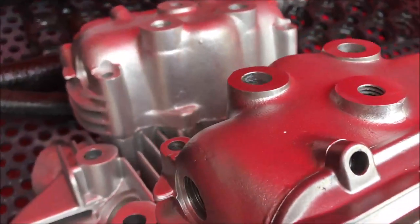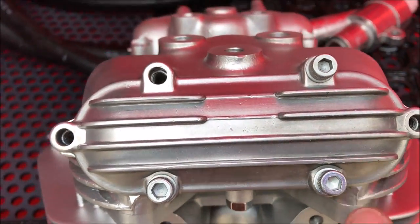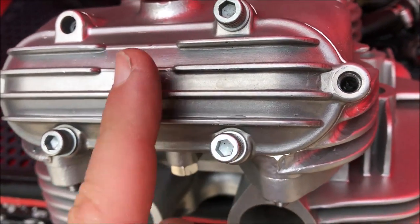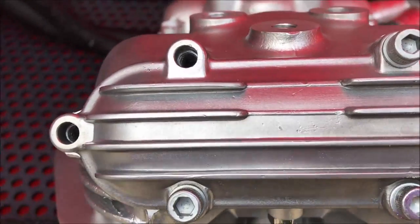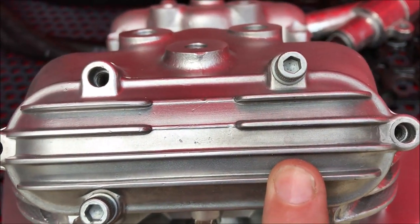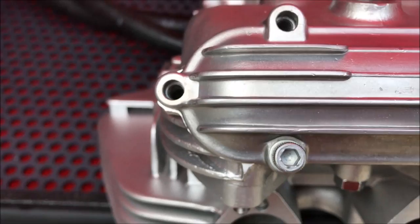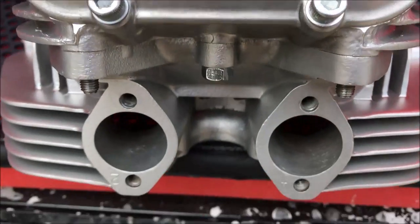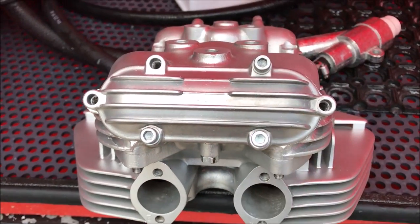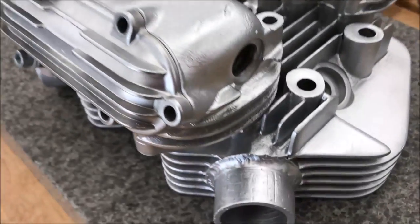I've got a little more touch-up to do. You can see from the left going to the right this is where I originally did that first half, and you can really see there's like a shadow here. This is really making a difference compared to traditional media blasting — you can actually see where it looks dark or stained, and then you look at the vapor-honed side and that is just gone. I need to spend some more time in here before I showcase the final product; I'm not happy with this yet.